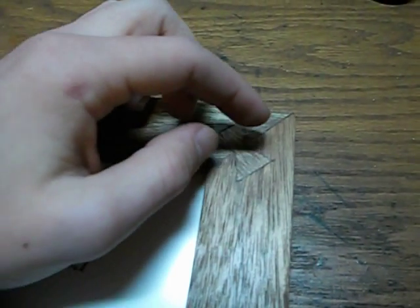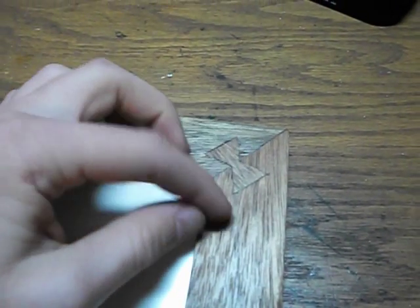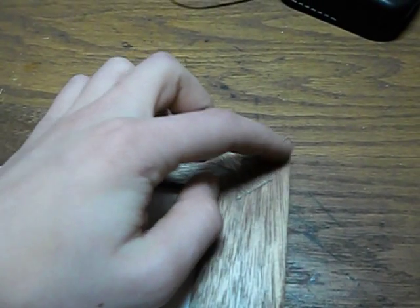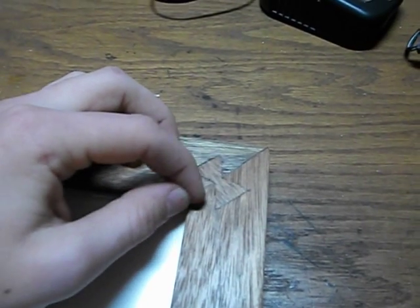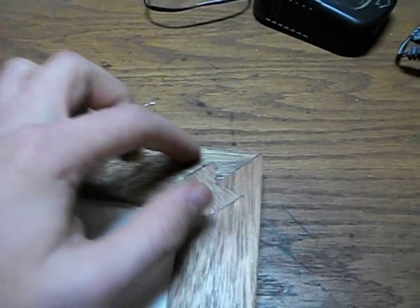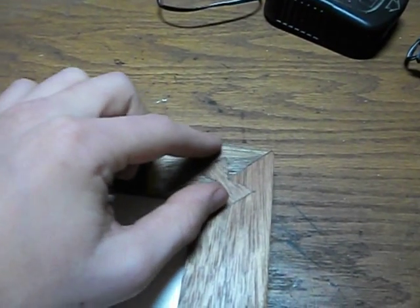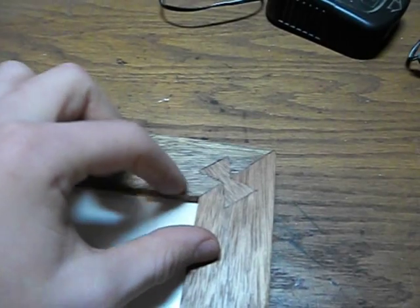So how I spaced this: this here is three quarters of an inch, this is an inch, that's about an eighth inch inside. I just beveled the inside and then took that three quarters of an inch up like this. Over here there's a little more than three quarters of an inch, but I tried to make this pretty centered — probably five eighths to the center. So that way there's still enough space on this side for it to be strong, and still enough space on the other side. Because if you push this too far over there would be no wood here and it would just chip off the whole corner. So there has to be enough space inside of this — if it looks too small, move it up a little bit.